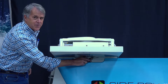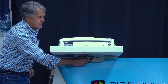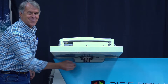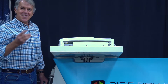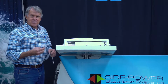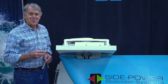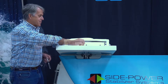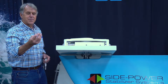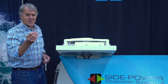Just back it out. There's a specification in the manual that tells you what the torque is for installing this fin after the exercise. Read the manual — this is a refresher or a general guideline. It's really important to read the manual. There are some very specific torque specifications and sequences. A lot of things these days you don't need to read the manuals for — you do with the vector fins. I've removed this fine thread hex-head bolt. They're not easy to find. This is a very fine metric thread. Don't lose it. Keep it clean.